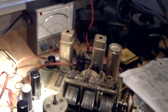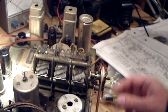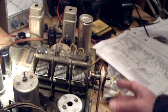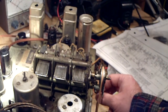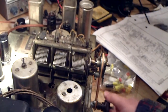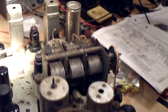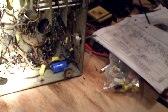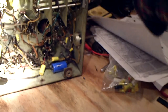Here's an extra tip: I took the dial off the radio. You can see I have just a tuning capacitor hooked up with a new belt. You actually have to take the entire dial off to put the belt on — that's how it was made. I got a new belt from Adams Manufacturing, who make all different size belts for antique radios. I also took the whole dial off so it wouldn't get damaged, balancing the chassis against the old electrolytic capacitors.